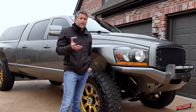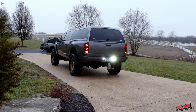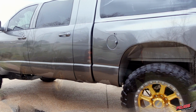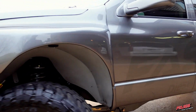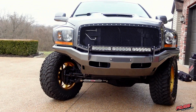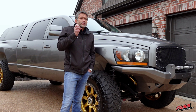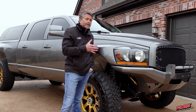Or you can just hook it up the other way to where you just start the truck and let it warm up. The reason I did it this way, because I was at the St. Louis airport once, getting great pressure, it shut down. Started up, get great pressure, it shut down on me. Found out the cascade valve was frozen, it was not opening up and it was building too much pressure and it was shutting the engine down.